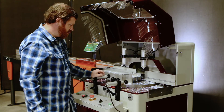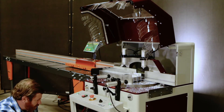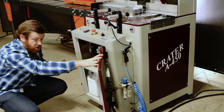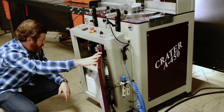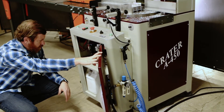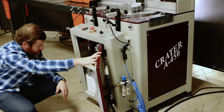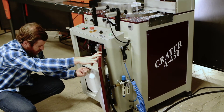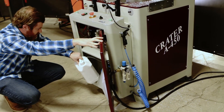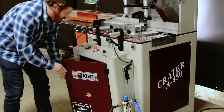The controls are pretty simple, which is important. As a technician, I care a lot about being able to source the electronics — it uses Schneider Electric components, so you can go to your local McMaster-Carr or local electrical store and get a spare part if you ever blow a fuse. The lubricant reservoir is down here — this is the cutting lubricant and it stays in that jug right there, sitting in the front of the saw. We use Unist; we think they do the best job with cutting tool lubricants.